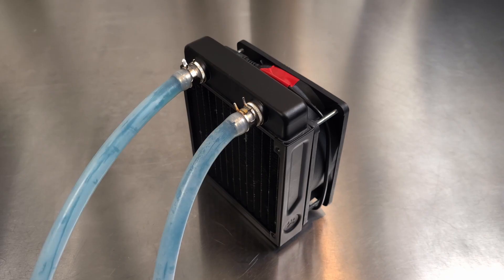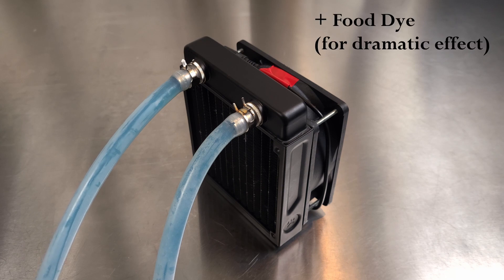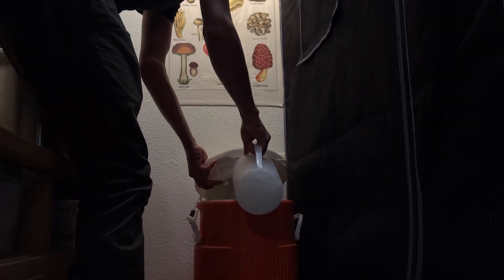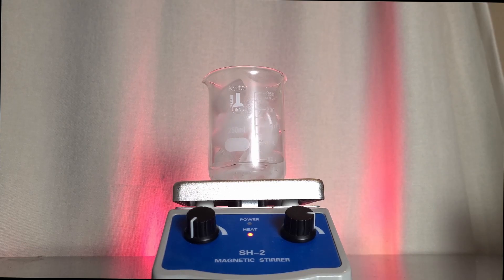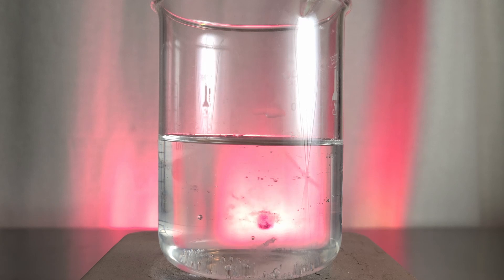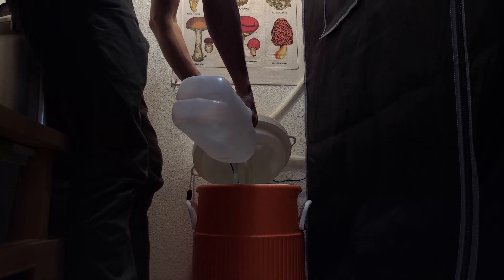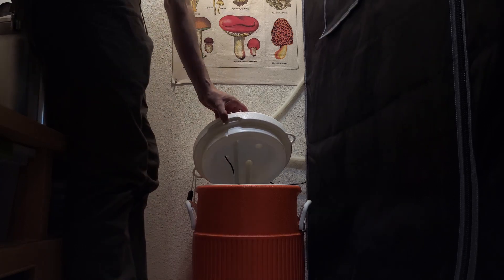You probably thought, because I've been saying coolant this whole time, that there's some interesting chemical involved — but there's not. It's just water, though it is distilled water. When I first got this system going, I was using tap water and ice made from said tap water. But as you can see here, the minerals in our water precipitate out when frozen and melted, resulting in more and more mineral gunk accumulating in the water with each ice dump. So to avoid clogging up the tiny tubes of the radiator with mineral crud, I filled the reservoir with distilled water. And to avoid the introduction of mineral scum via the ice, I bought four large ice packs — two I leave in the reservoir while two more refreeze.